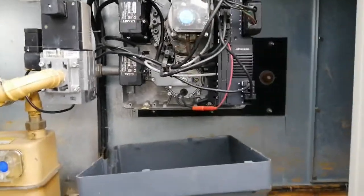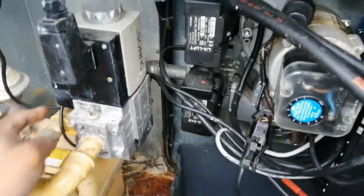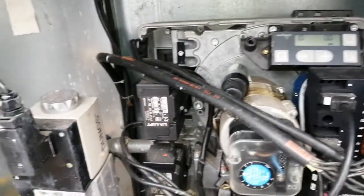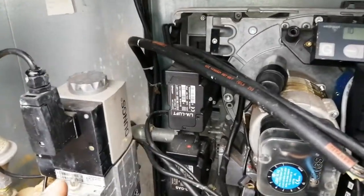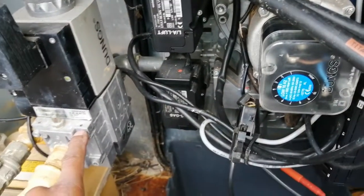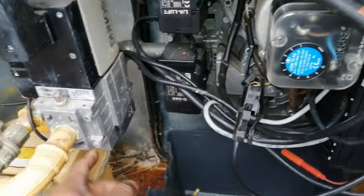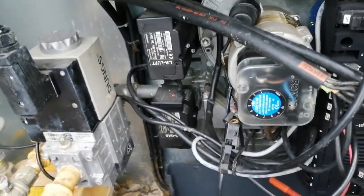So the unit wasn't working, and I thought it was the gas valve. I took the leads off the gas valve because it was tripping the MCB — the miniature circuit breaker. When I took the leads off the gas valve, it stopped tripping the MCB. Because the gas valve was so easy to take out and I had another one on a working unit, I just took out the Allen keys, pulled off the leads, and swapped them over. But the unit kept tripping out.